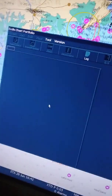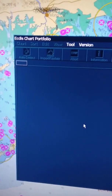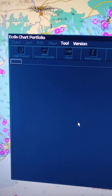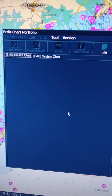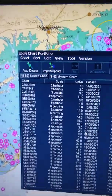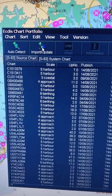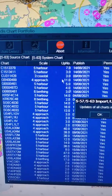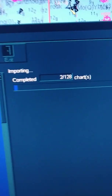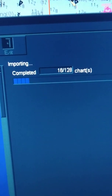Whatever is included in updates, the ENCs will be here. After this, one more step is there to update our AIO — I will show you the step after this one. It has detected that these are all the cells to update. I will select import update. Updates accepted. Now I press OK. You can see here 128 updates are there and it's on the way to update.